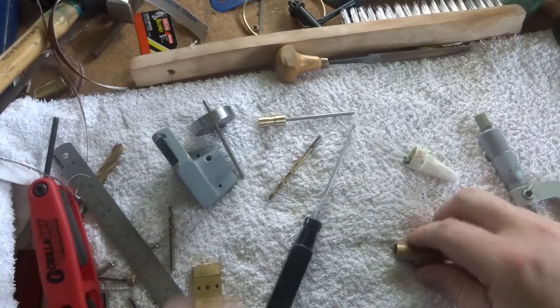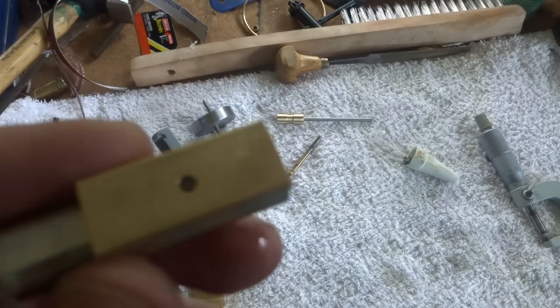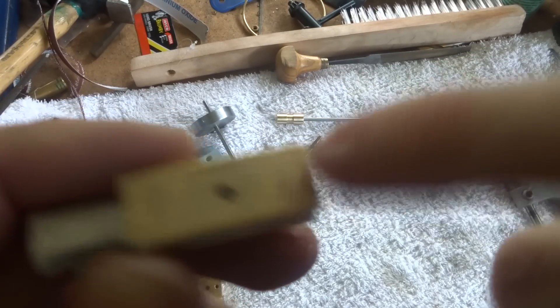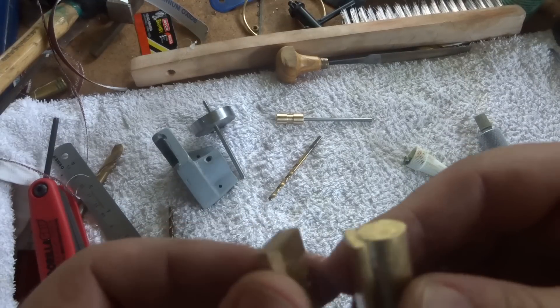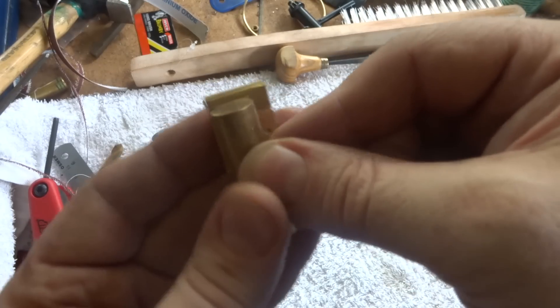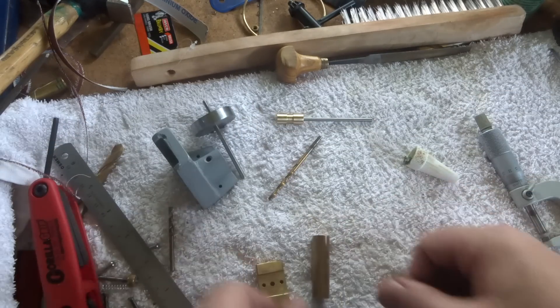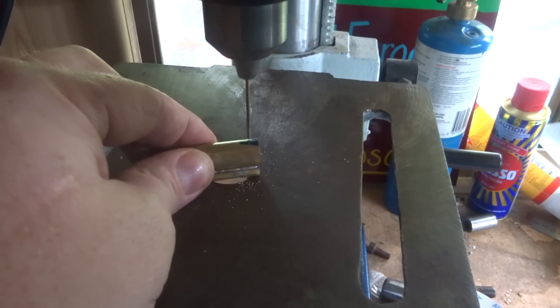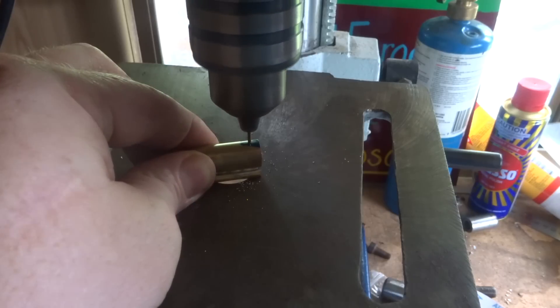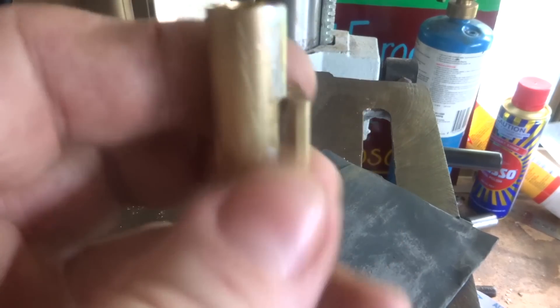While that's drying, there's one more job — a little 1.5mm hole for a steam port that goes right the way through. What we can do is set it at the extreme edges and drill through, or mark through, and we've got our holes in the right spot for the port. We'll put that right on centre — we don't want any muck in there. We're going to put the piston back in. I reckon some soapy water and a scrubbing brush won't hurt that.